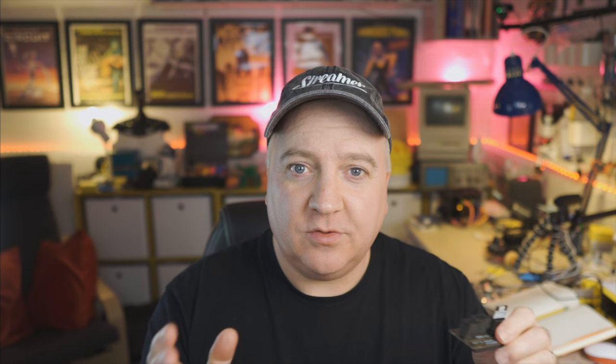The wiring isn't optimized yet but the model works very well and I'm very happy with the design so far — and you can see it's very similar to the Trilobot. The next steps will be to finish the design, keep iterating through until I'm happy, and then start working on the code. I can use the Explorer HAT code from Pimoroni to make the motors go forwards and backwards, take readings from the range finder, use the Raspberry Pi camera library for images, and OpenCV for image processing. I'm also intending to make this remote-controlled using an Xbox controller — Pimoroni have that code available in their Trilobot repository. I might also add breakout garden headers to bring in extra modules easily. I hope you enjoyed this video, and I'll see you next time!